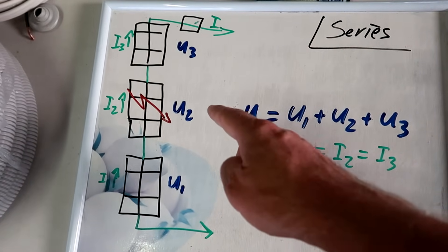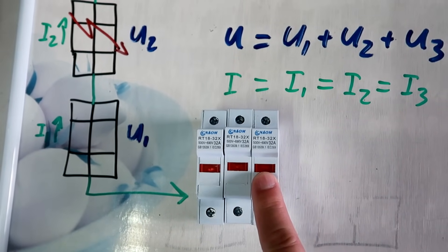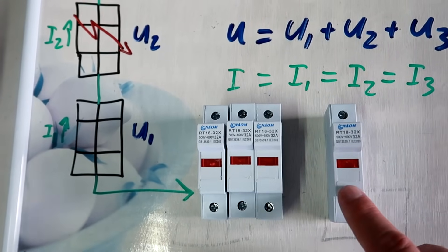Nevertheless you should have a fuse in your solar panel string — in this case a 10 amp fuse, because we have a 5 amp current through this solar panel array, and if one panel is faulty the current does not increase. So in a series connection the current through the panels stays the same but the voltage adds up depending on how many panels you put in series. From a safety perspective the series connection looks far better because you need only one fuse, and in case of a faulty panel you don't cause a fire or any problems at all.